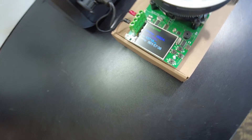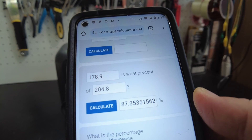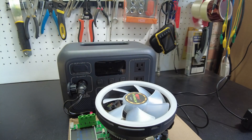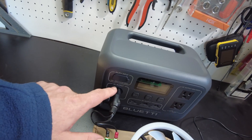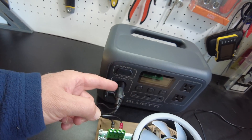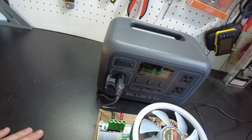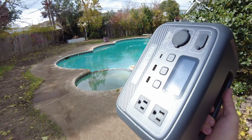So we just stopped and we came in at 178.9 watt-hours. That gives us about 87.35% of the rated capacity. That's probably about right for having to go through the cigarette lighter jack, since there's some conversion — we clearly lost a little over 10%.